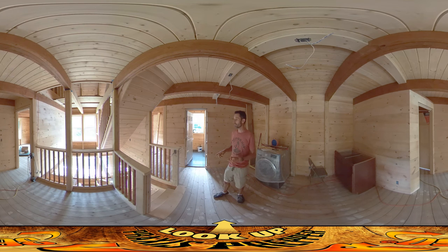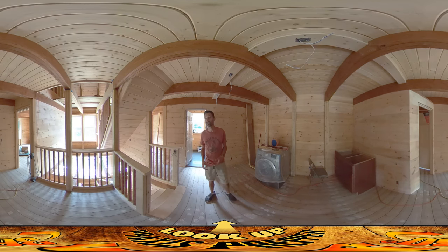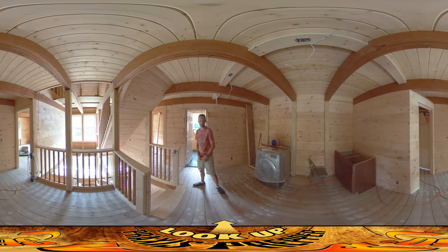My dad had looked up the regulations, did the math, and found out that some of these boxes, technically speaking, were a little bit on the small side. But in the real world, this is no big deal — just running to a wall switch. There's actually plenty of room in that box versus the math that says you can't fit that much and you need to get an even bigger electrical box, which is a problem when you get them up against each other.